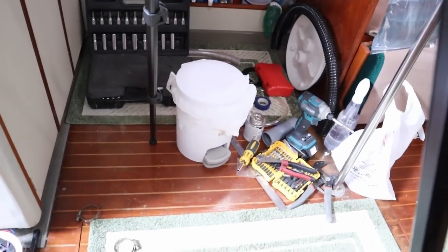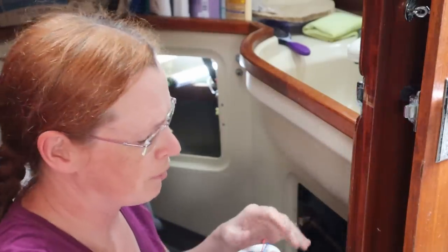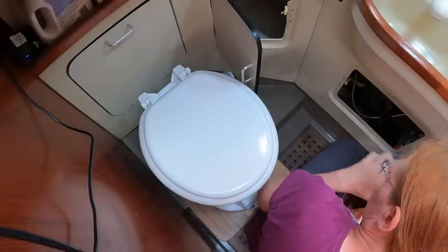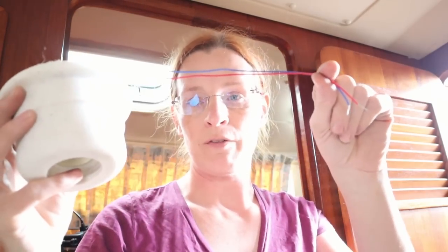That quick disconnect, I am gonna use it, but in the final install. I'm not gonna use it for the trip home. The wires that come with this are very, very tiny gauge. I have to figure out where to wire in. I need a 12 volt supply now. I think that's what I need to figure out next. Because these wires are so fragile, I'm gonna go get some of the black and white wire that I was using for the lights yesterday, the anchor stuff. And I'm going to make longer pigtails off of this because I don't imagine this draws too much.